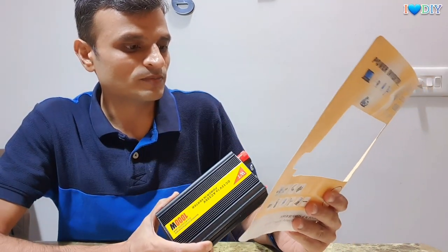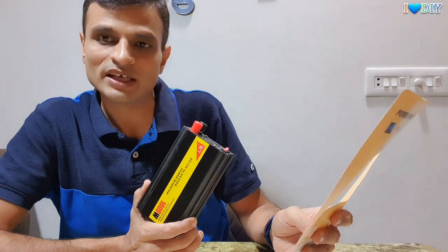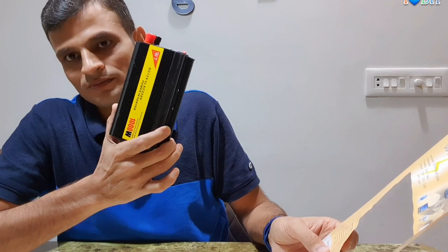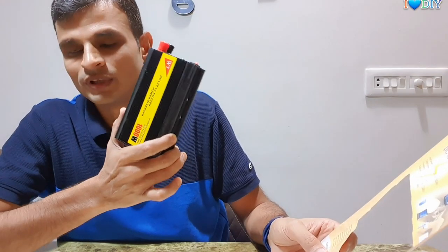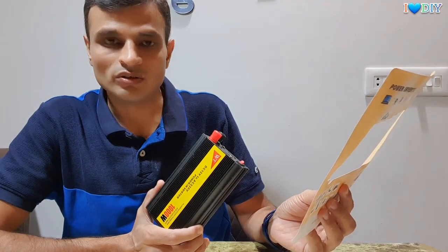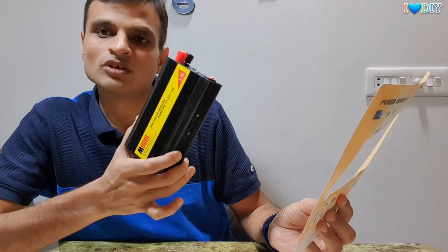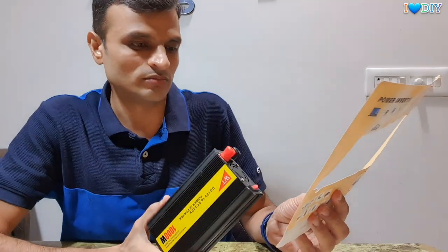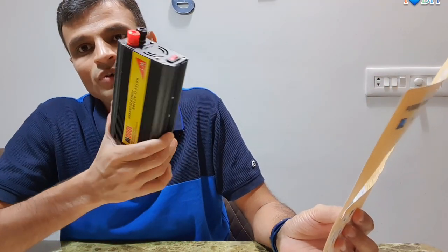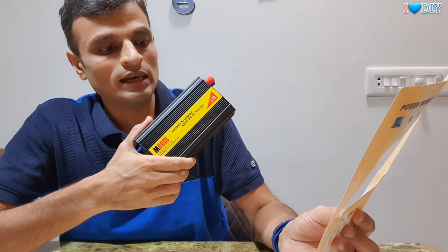The frequency is 50Hz and 60Hz compliant. The low voltage cutoff is 10.5V ± 0.5V, meaning if your battery drops below 10.5V it will switch off — this also safeguards your battery so its life is not affected. The high voltage tolerance is around 14.8V. One more important spec is no-load current: if you have left this attached to your car, how much is it draining the battery?